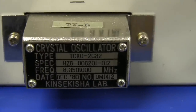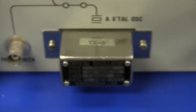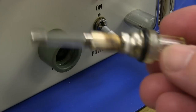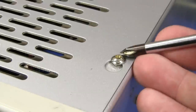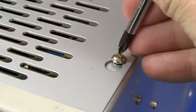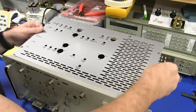The audio TCXO is at 8.3501 megahertz. Both manufactured in December 1980. They're relatively small for temperature-compensated crystal oscillators. And what looks like a weird old-style lamp is actually a fuse holder complete with O-ring. The top panel is designed to be easily removed for servicing — they've used a larger cut-out so you don't lose the screw. Undo the screws and the panel just slides off. Brilliant.